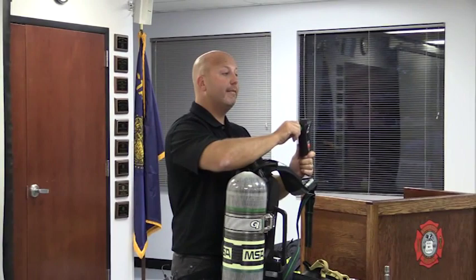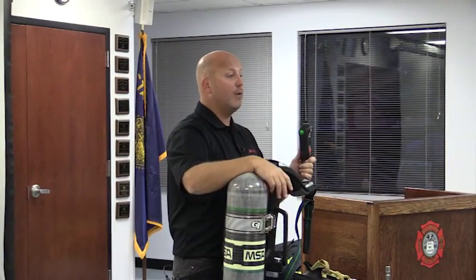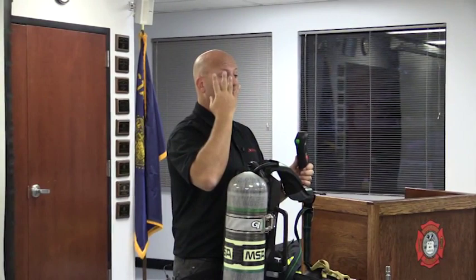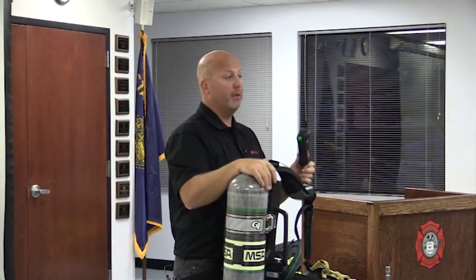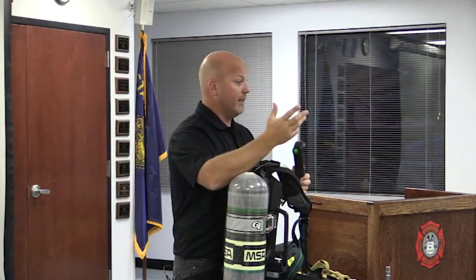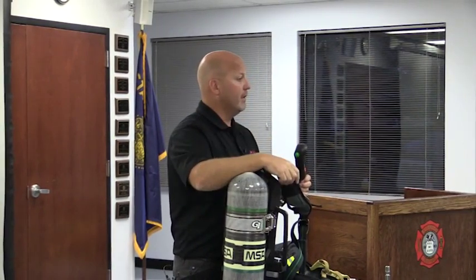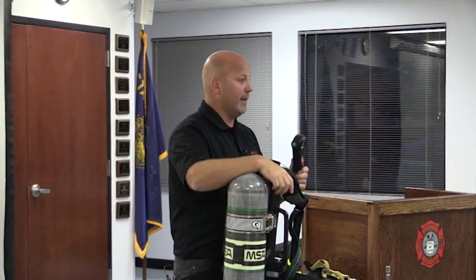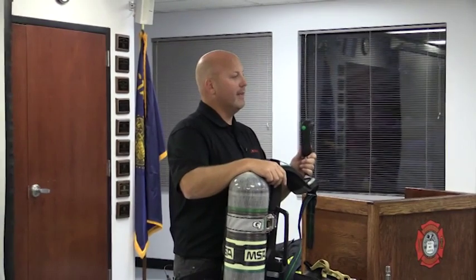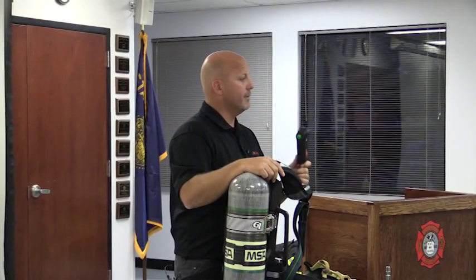Yep, it does as well. It brings your heads-up display lights up. Depending on how you have your heads-up display lights set, your department has them set so it comes up intermittently, so that would bring those lights up. If you wanted those lights as a group, you say, we want those lights on all the time. Your SCBA technicians have the ability to change the setting of the SCBA so those lights are on all the time. There's a lot of customization to the SCBA if you so desire. So if there's something you don't like other than the sound, let the SCBA techs know, and there may be the ability to discuss pros and cons of making an adjustment.